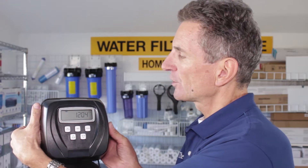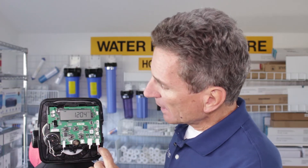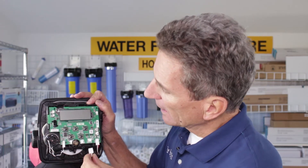There are two little tabs on each side that you can use to remove the faceplate. You'll see there are three connections that have wires going to them at the bottom of the circuit board. You want to undo the second one from the right — it actually says 12 volts AC beside it.